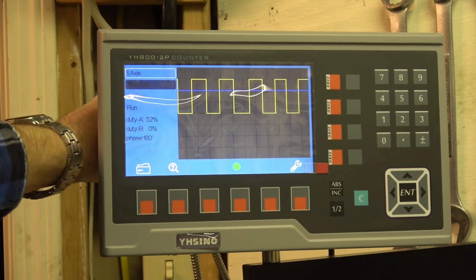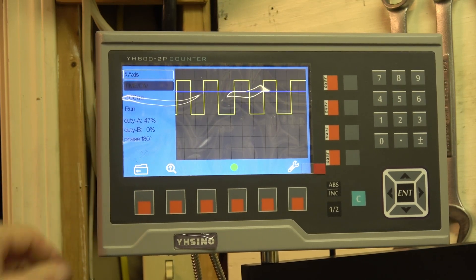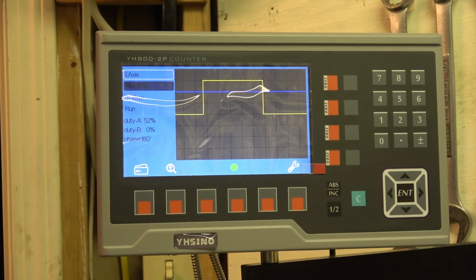The wires are screwed in well. I jiggle the cables and that does not fix it, and I jiggle the cable at the scale itself and that does not fix it. Something funny is happening here and it's erratic — sometimes it works properly and sometimes it doesn't. I'm going to try to chase down what's going on.